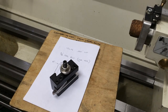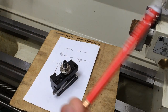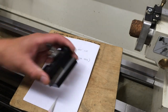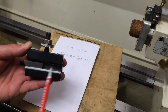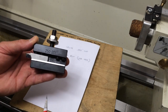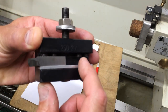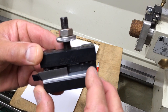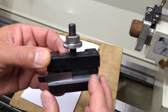A viewer requested what I was using to make that 200-thou cut on the 12L14, because it wasn't creating a big long chip - it was creating real short choppy chips, which we all like. Here's the tool bit I ground and used. It's a USA high speed steel - I don't think it has any cobalt or anything special in it, just something from ENCO. This strip you see here is a piece of eighth-inch aluminum that I put there to absorb vibration.